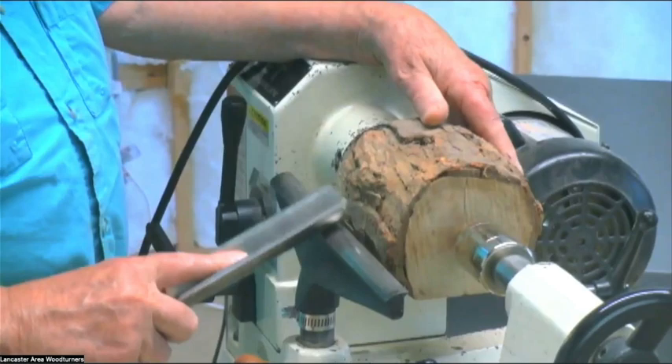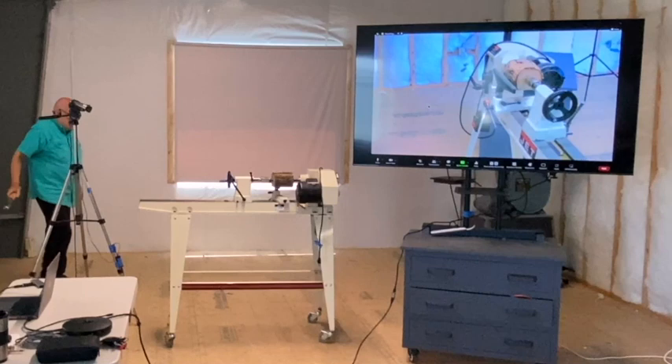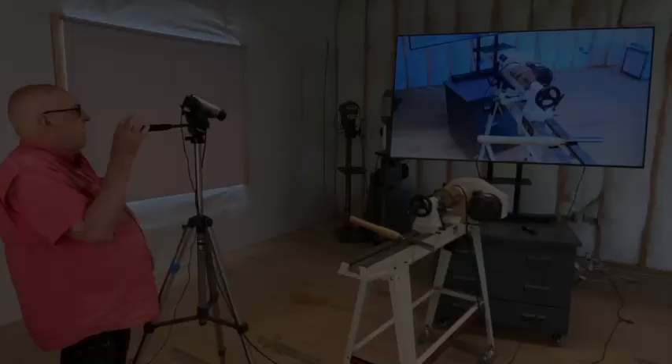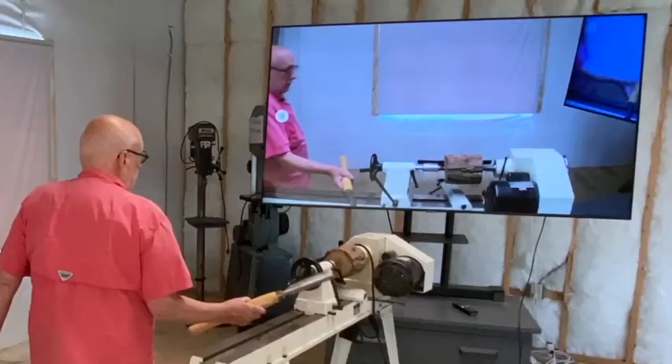Now I'm in the shot. See my turning tool. I could go like this and cut. I can also zoom this camera in and out. When I go out with it, I can move it up like that, and now I can see the stance of the turner and how he holds the tool against his body, and sways from the ankles to move along the workpiece. From my position here at the tail, it's really quite easy to pick up the tripod and come around here for a better view of faceplate work or a good look at the turner at the lathe.